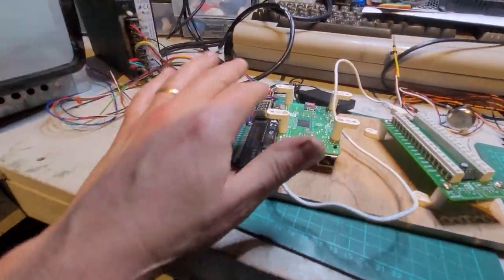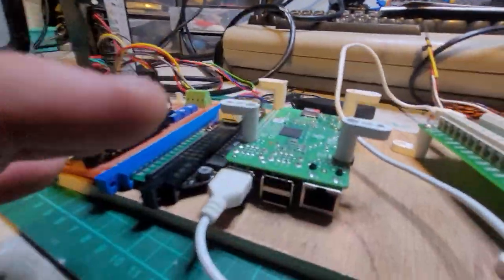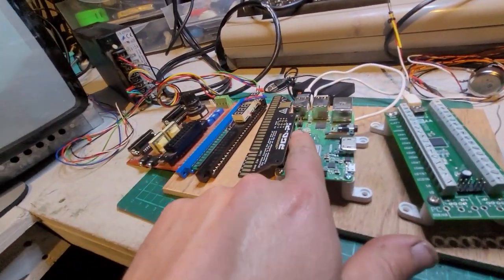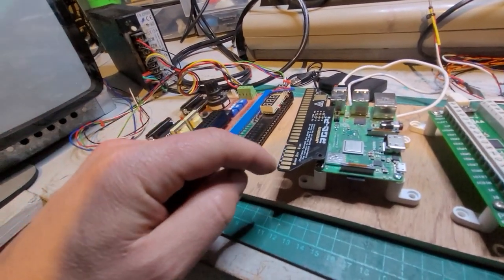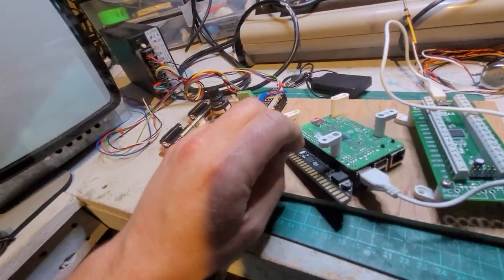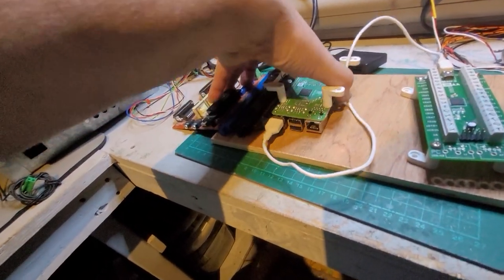With the SD card ready and the RGB Pi connected to the Raspberry Pi, be careful: the JAMA connector on the RGB Pi is inverted. Normally ground and 5V are on one side, but here they're flipped. If you connect it wrong you will burn your Raspberry Pi, making this build much more expensive. Flip either your JAMA connector or the Raspberry Pi orientation before connecting.